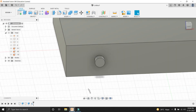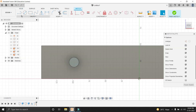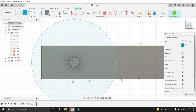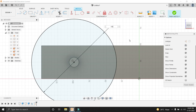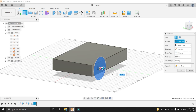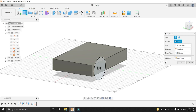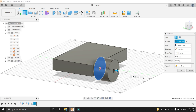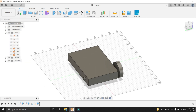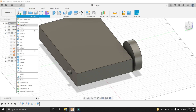Now let's create a wheel on this face. By selecting this face, we will go into the sketch tool. By clicking the sketch tool and selecting the center of this face, we will create a wheel here. Give it a dimension of 100mm. We will go out of the sketch, then use the Extrude command. This should be a new body — select New Body. Let's give it an extrusion of 25mm. Press enter. As it is a new body, now let's mirror this thing. Press OK.